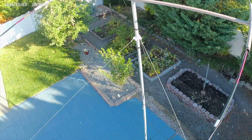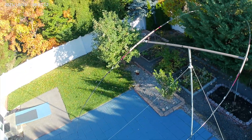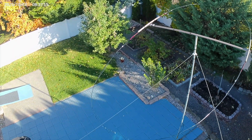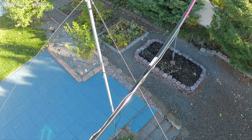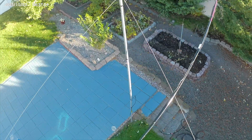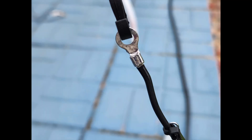Here's what the antenna looks like once it's assembled. I wrap that 14-gauge antenna wire about one turn every 18 inches or so close to the boom. Then as I get out to the ends where it bends more, I do a few more wraps and put some more frequent black plastic electrician's tape to retain it. I also use a zip tie at the very end of the fishing rod where there's an eyelet. And I like to use ring terminals at the very end of both the driven element and the reflector, because it makes it easy to attach with those ring terminals in place.